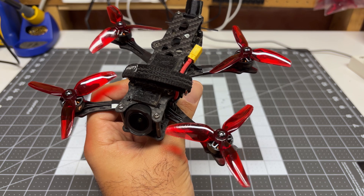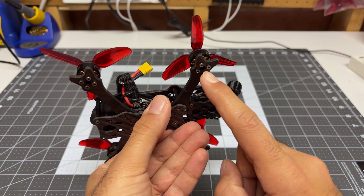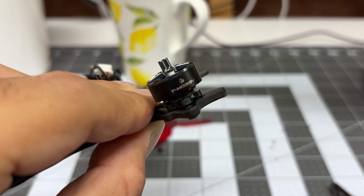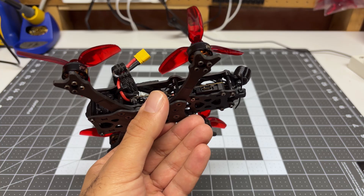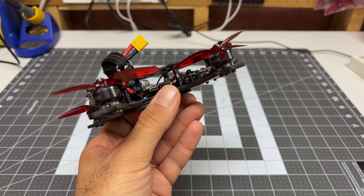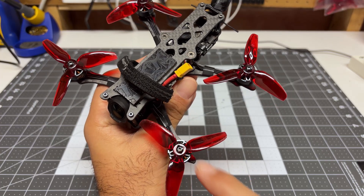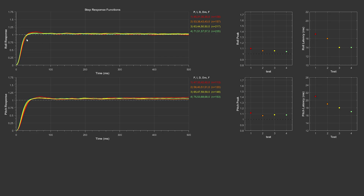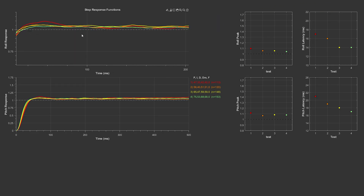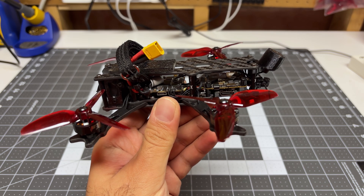The motor is installed just like any other motor would install. The only issue I had was with the motor screws — the screws that came with the motors were too long, so I had to go rummaging through my spare parts box and find some shorter screws. Do bear that in mind if you want to use these motors on smaller quads. I did also go ahead and do a fresh PID tune using my go-to software, which is PID Toolbox. I'll give you links in the description to my Betaflight configuration file along with the actual PID and filter tune.